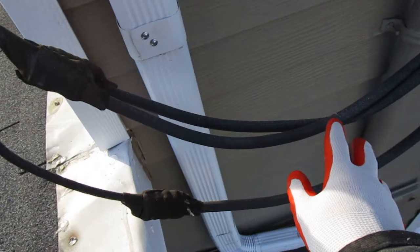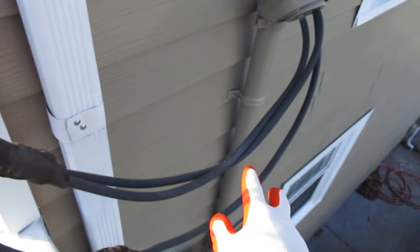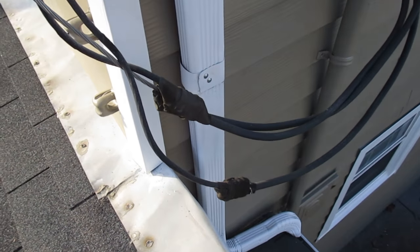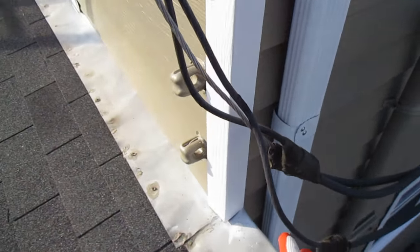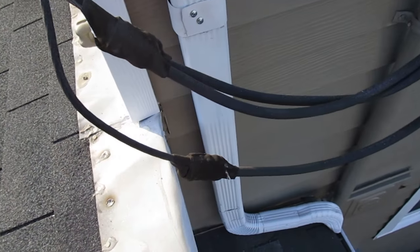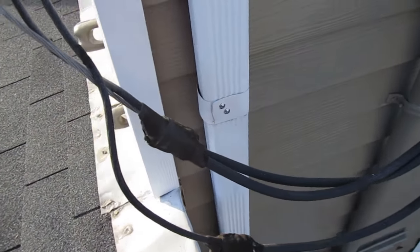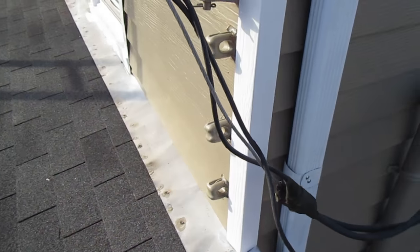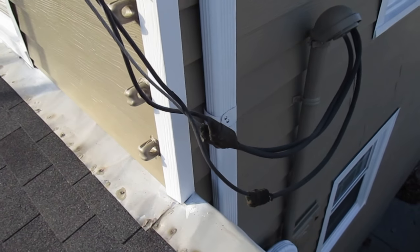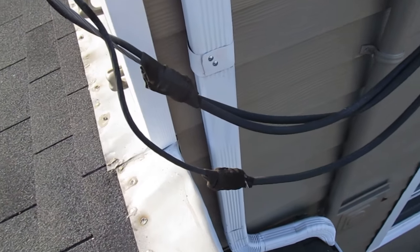There's no issue here. The reason the enclosed wires need to be larger is that being inside the conduit causes more heat buildup. Keep that in mind if you notice the size difference going into the service wires. If in doubt, refer to your electrical or service provider, or consult a certified electrician.